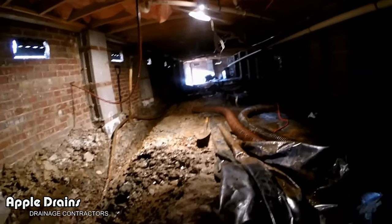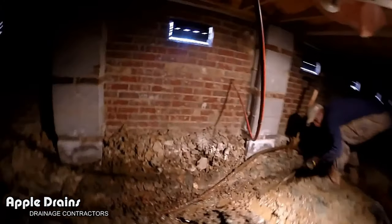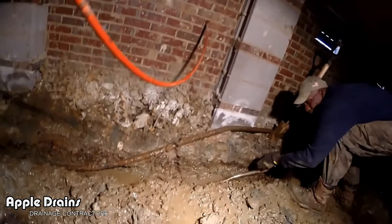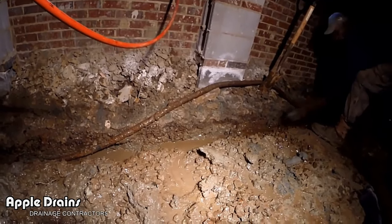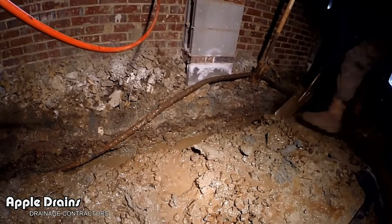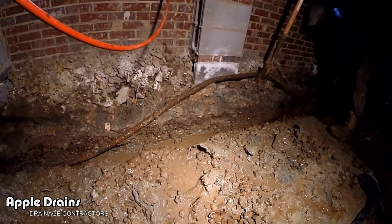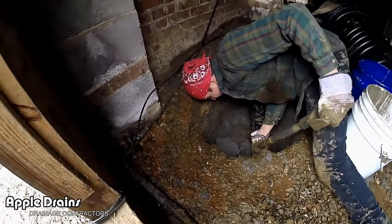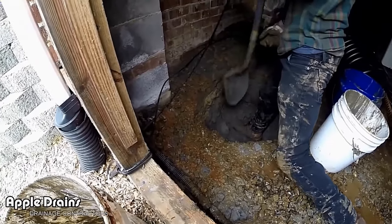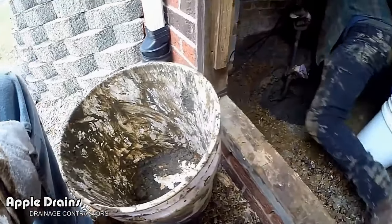We'll put another pump at the other end also, and it needs to get down about 10 to 12 inches. There's a nice little flow of water coming through there. Digging out the old trench - the gravel makes it a little tougher since it's wet and stops the shovel from going down, but it moves right along. We just need to be down below that footer, then we'll put new gravel and a new pipe in. Paul's moving right along - he's just about got it deep enough to put the pit in. We fill up these buckets and go dump them.